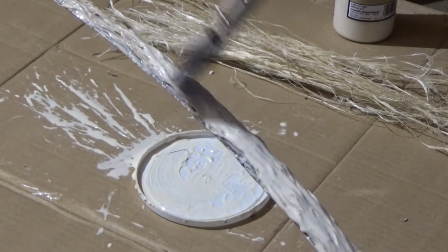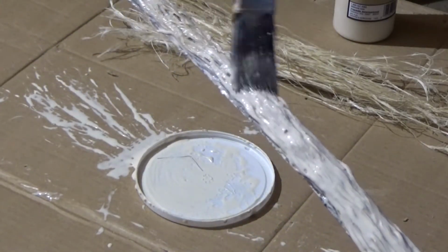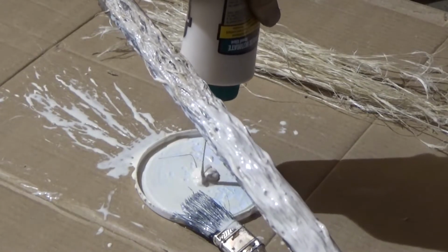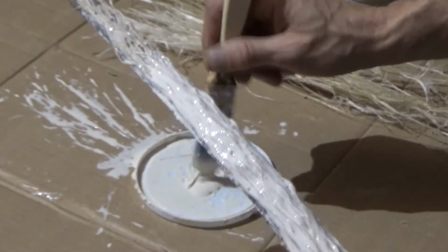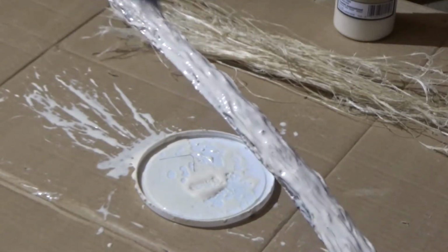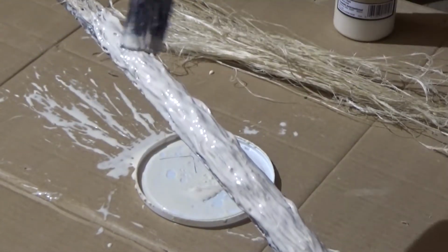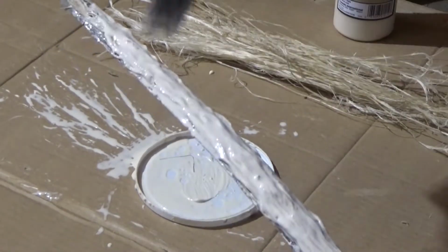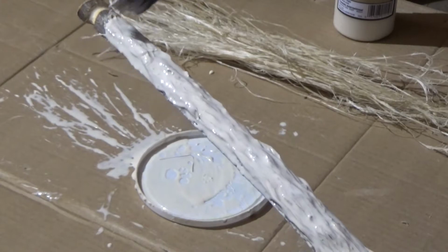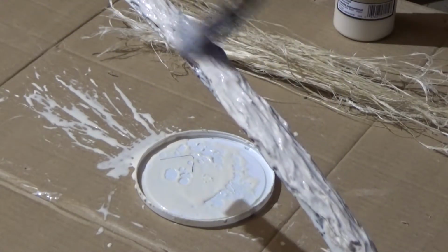And I know that the way that white glue typically behaves is it tends to shrink a little bit when you try to fill in large holes. It's better meant to seal in joints, right? So I'm not expecting this to really fill very well, but I am expecting it to grab and hold very well. So I'm going to let it dry, and then I can choose to sand it, but I'm going to wait and see what it looks like when I'm done, because I have a feeling that it might look really cool, and for a young boy to get this as a gift, if it looks cool and strange and unusual and a little bit unfinished, all this roughness goes back on here, I think that'll probably have some cool factor for a young boy.